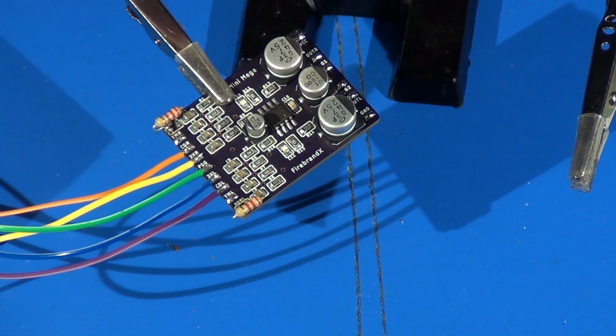So honestly, what I will probably end up doing is obviously use the ground over here for the board and my voltage, and then I'll use one of these 2 additional grounds to provide my separate ground point to the actual RCA jacks. So that's what I'm going to do now, is go ahead and get some additional wires soldered onto here.